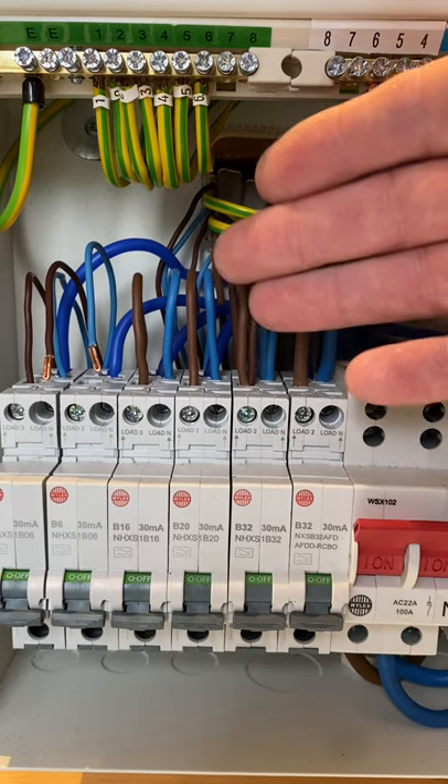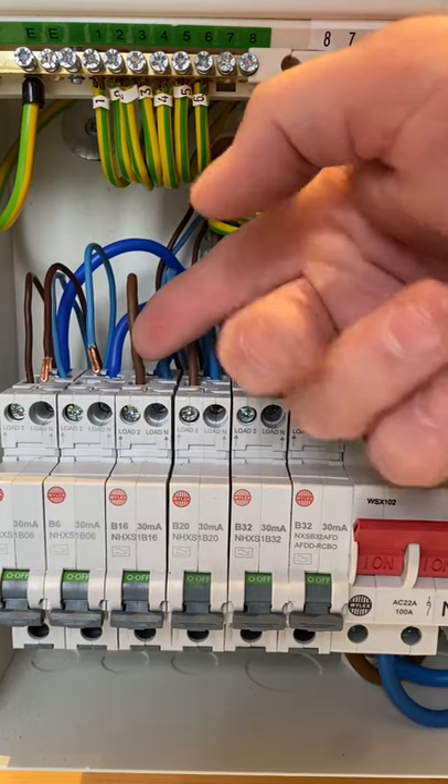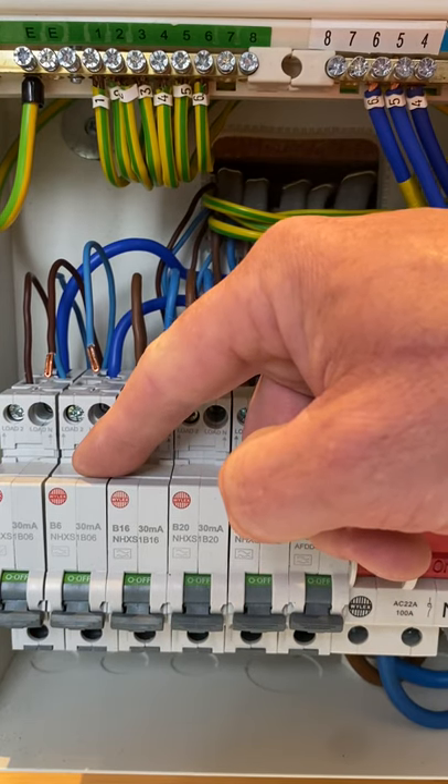It's time to think about carrying out my RCD test, and that means all loads need to be removed. I've used this circuit here as an example — I've disconnected my lighting circuit from the top of the RCBO, saving me running around the installation removing lamps.